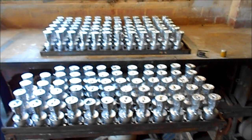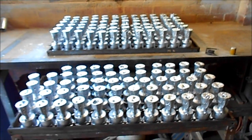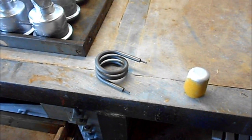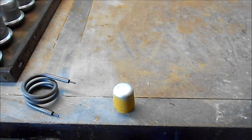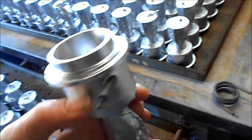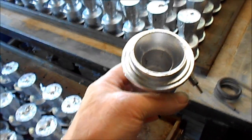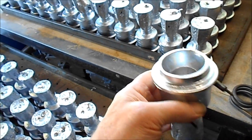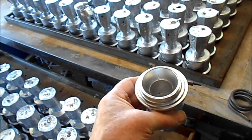Well, this is the day's production — there's 130 there. I guess the die produced about 17 castings an hour. It was a very long and very tiring day. Here's a closer look at the little heating coil that actually goes in the casting — that's a 1600-watt coil, so it packs a fair punch. And this is the little sand core I stick on the end of the metal core inside the die. This forms the inside of the casting. The amount of water this thing heats at once is only a couple of tablespoons that sit in that very inside cavity. I believe it blows it up a central column as steam, so it heats some water very quickly — that's one of the advantages of the urn that these things are used in.